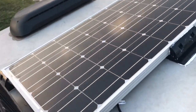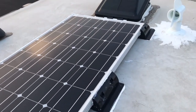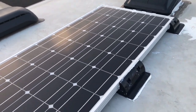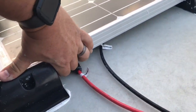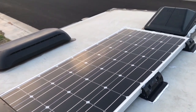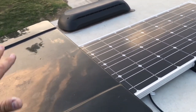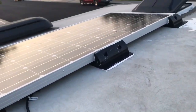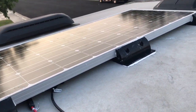The panel itself is a Renogy solar panel, and it has the Renogy mounts. I'm using Sikaflex so I can basically mount it straight onto the actual roof — this is a no-drill mount solution. It is rather solid and not moving anywhere; I mounted this about 12 hours ago. Because this is my first install, I put it directly behind the air conditioner unit. It has enough clearance and breathing room, and while driving, the air conditioner actually creates a slight windshield for it as well.